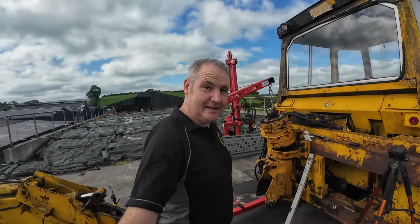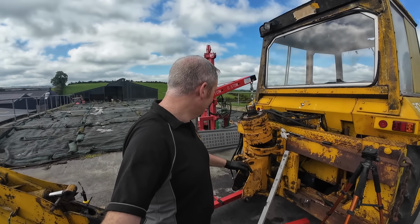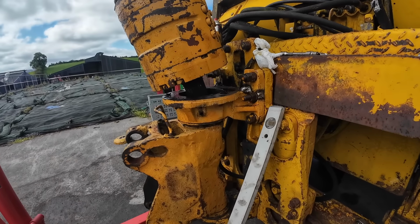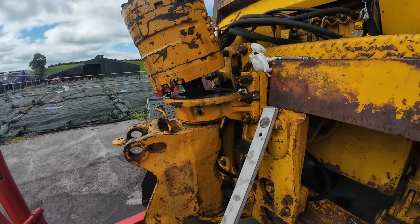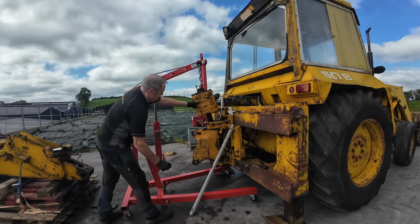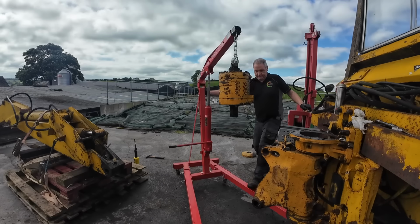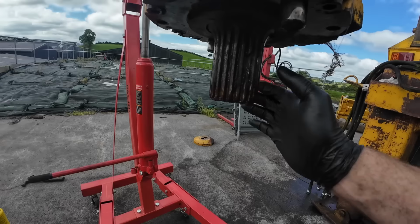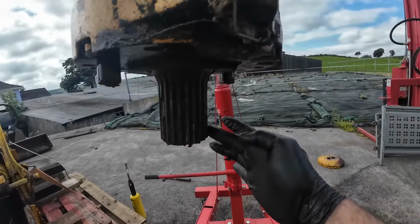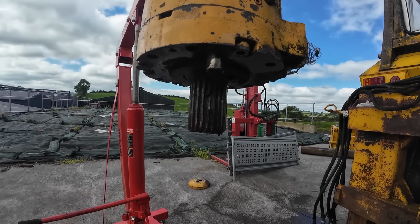All right, so you've seen it and I didn't, because I was away off to get a bit of a crowbar, put it on the gap and give it a little bit of a reprise, but then it decided it wanted to come out. There it is, our slew motor is lifted out. Oh, I see problems. There's a tooth broken, one of the splines broken straight off. The rest of them, funny enough, don't look too bad. I don't know if that's something they can fix or not.